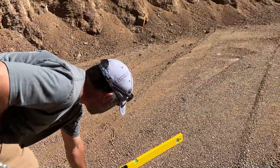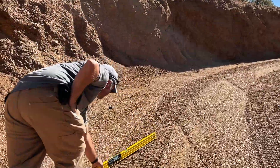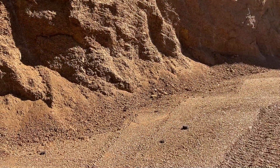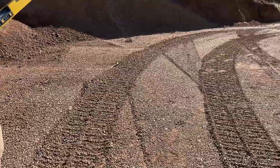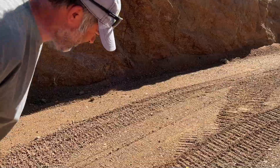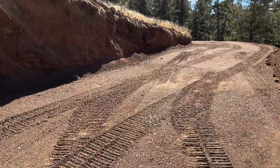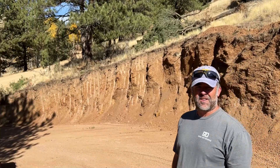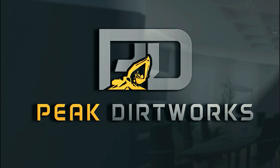Center line of the driveway once again — 14%. And like I said, you can adjust that; even if I move this it's going to change it a little bit. Come up here at the center line of the roadway — this is our 17%, so that's probably the steepest part of the driveway. And once we get up here we're back into the 12% range, and then as we go up we probably have 10% or less for the rest of the way. So that's today's demonstration. For more details on the laser seen in this video, see the description below. Be sure to comment and let us know what you think, and subscribe to our channel for more videos.